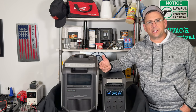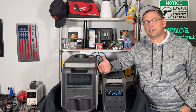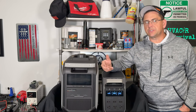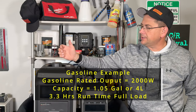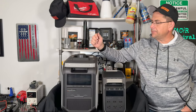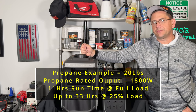When you slow down a non-inverter generator, you'll actually affect your frequency. Most homes need 60 Hz here in the United States, and when you slow down a regular generator it screws up your frequency — so if you buy one of those cheap ones, you can actually do a lot of damage. Speaking of fuel, depending on how hard you're running it, gasoline can run up to 3.3 hours. With a 20-pound propane tank, you can get up to 11 hours under full load, or up to 33 hours if the load is light.